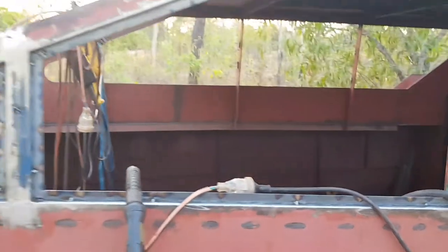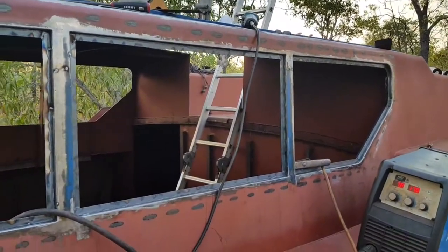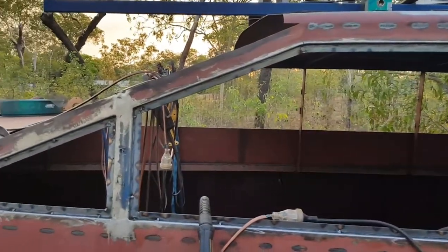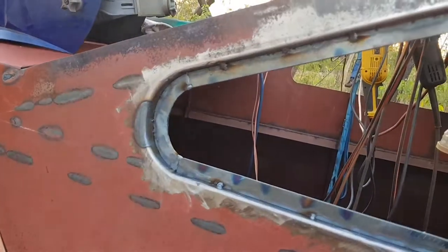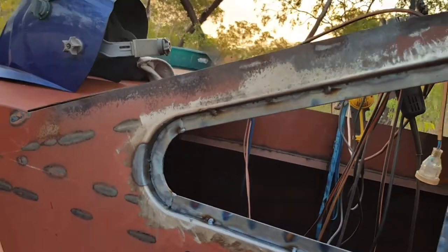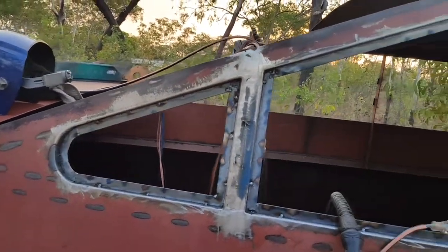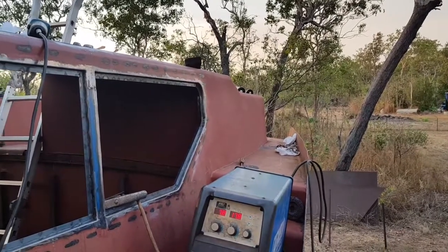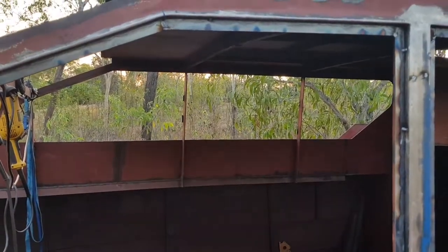This side kept me busy for a week or so — it was all trial and error working out how to make up the jig since there are no real guides on exactly how to do this. It's come out quite well so I'm fairly happy with that. Getting these radius pieces bent was a challenge — I did those by hand on the bench in a vice, cold-forming them with a hammer. It took quite a while and a fair bit of effort but they came out quite nicely. Same at the far end — I did those radius pieces by hand as well.